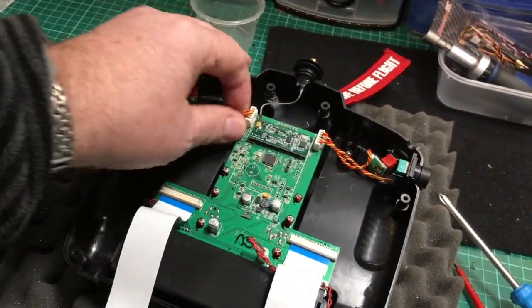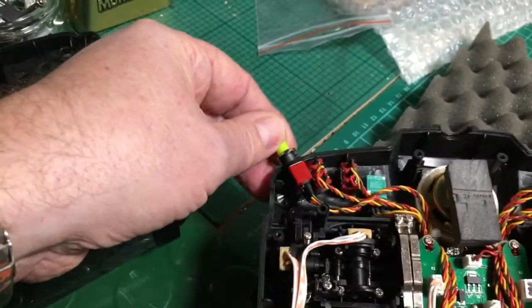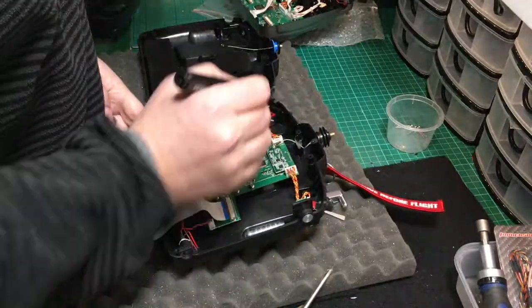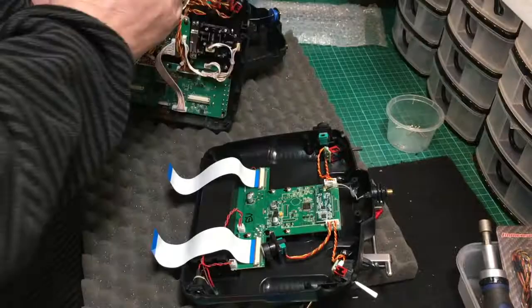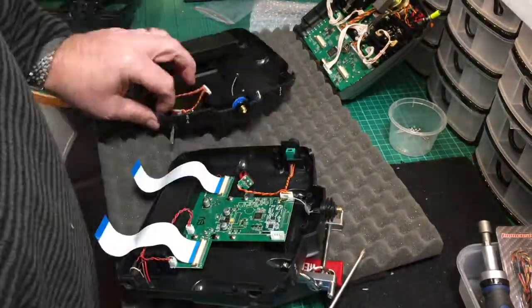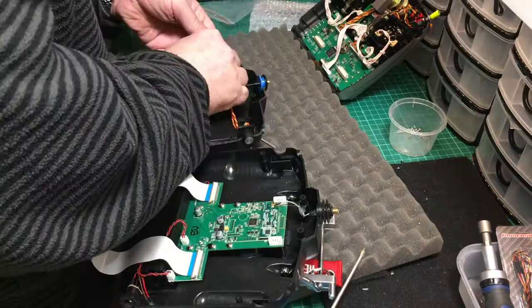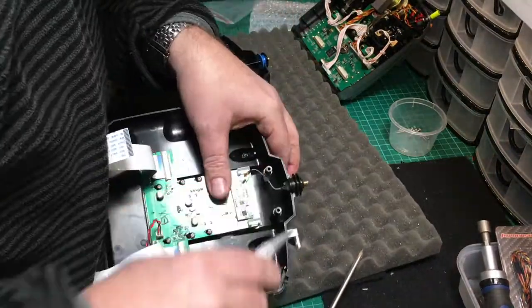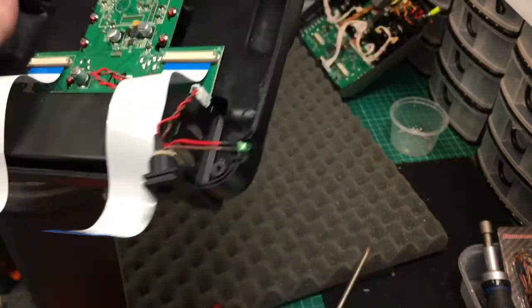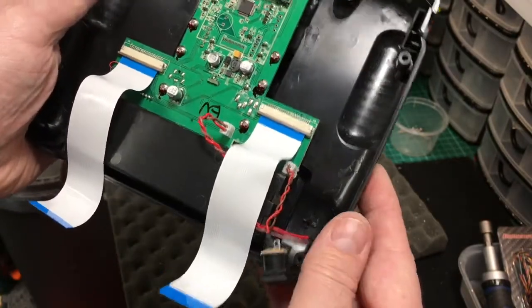So, it's not difficult. There's a pair of switches either side, same on the front. The front is probably more critical because you won't know which switch is which. These are already come loose, so that's the only thing to be concerned about — make sure you get the switches in the right places. Don't yank the LED out. I use something to push the LED out. If you yank it you'll snap the wires and damage the LED. So that's a little tip. So far so good.